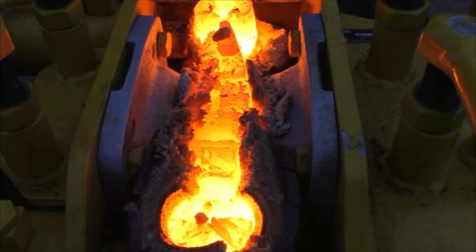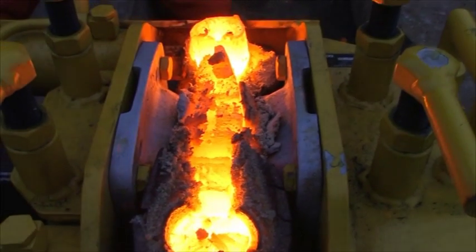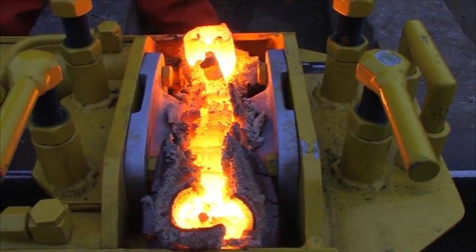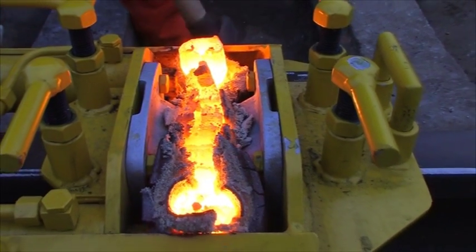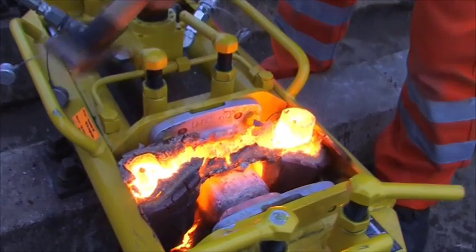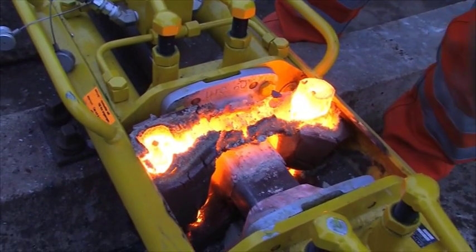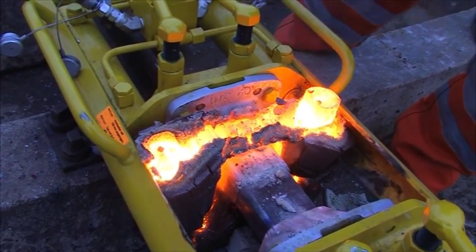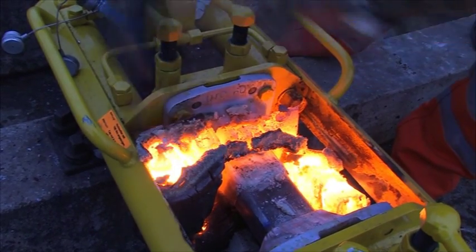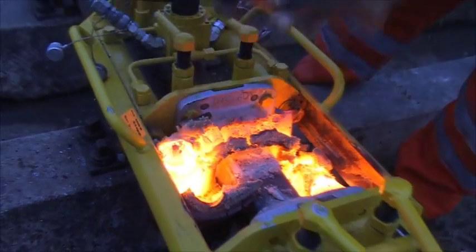Influences on the waiting times are the rail temperature, the used crucible system, the gap width, a different wear of the railhead, the matched preheating gases, an incorrectly set flame with oxygen excess, an incorrect preheating time, as well as specific portion grades. All these facts will be imparted during the welder's training.